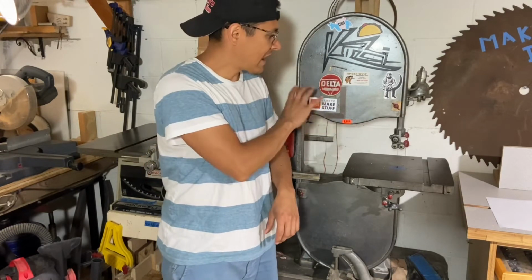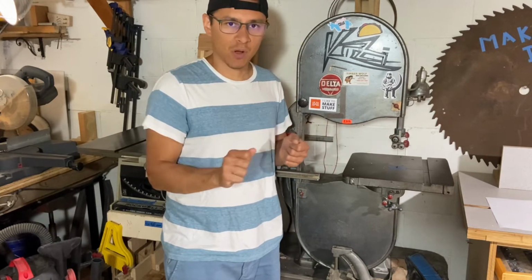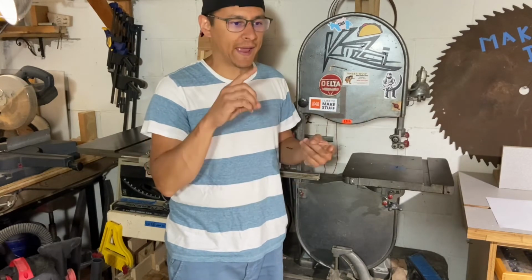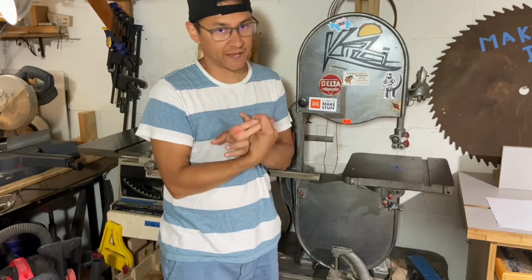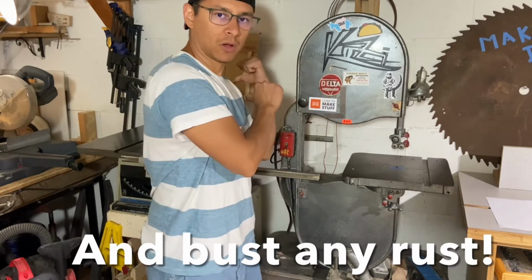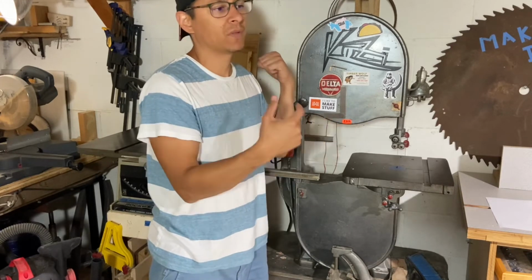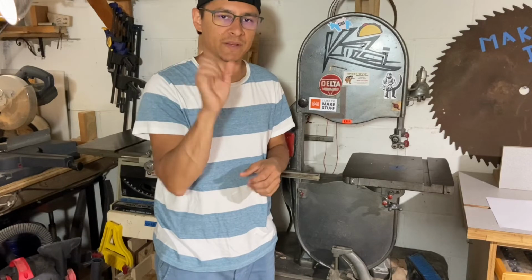And after that, now I start going into taking apart the individual pieces, making sure they're well lubricated, replacing any kind of oil like in the Dunlap scroll saw, and making sure that you replace any other pieces, parts like bearings, and definitely blades. So even though Homeboy did give me a saw blade and a brand new one, yes, I got 2 blades. One of them I had to ditch because some of the carbide pieces were broken off of them.